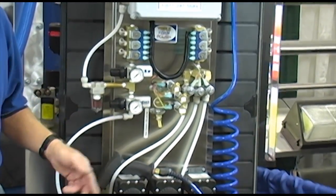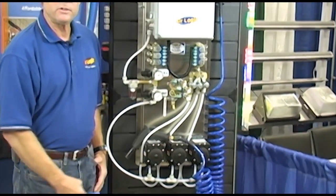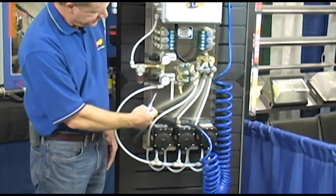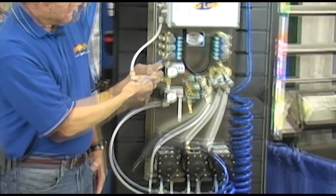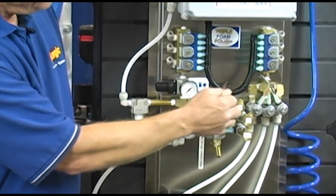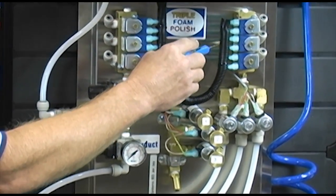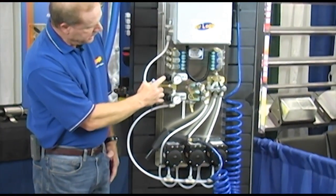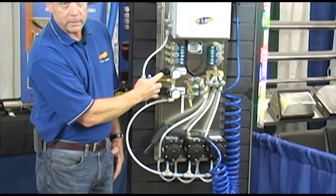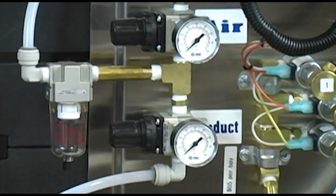This is our triple foam board. We use a three-pump system that switches colors every 10 seconds. It's all mounted on a stainless steel panel. This would be a three-bay system. You've got your air solenoids on this side, metering solenoids on this side for the product. We do have them available where you can adjust your metering screws inside. The air regulators and filter are mounted right on the panel also, so you can easily adjust your air and your product.